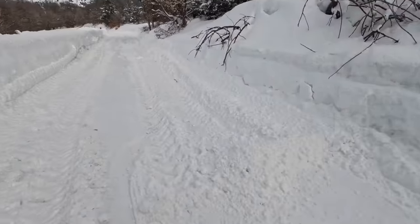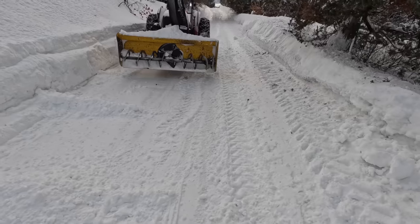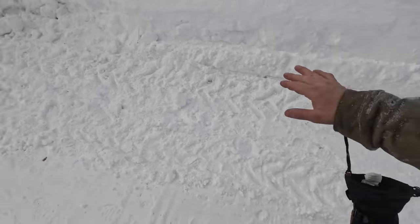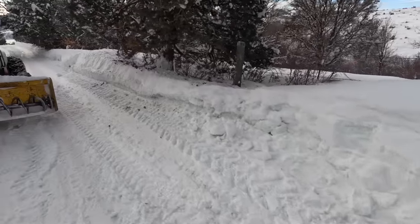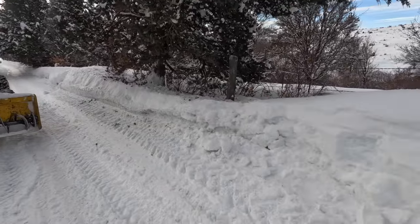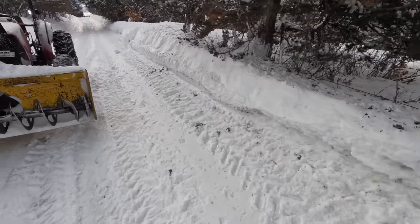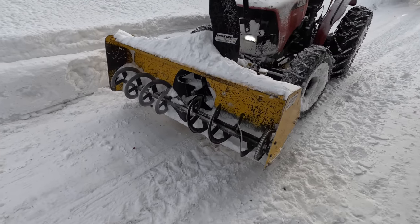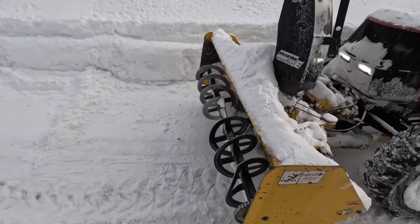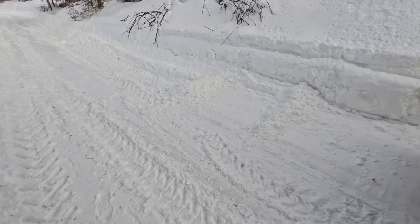This spot is just narrow, and I was just trying to open it up. We almost had it. I'm having a hard time on this spot. It's like it's compacted hard enough on this side, either from wheel track or snow blowing or from plowing, whatever. But it's packed up enough that I'm floating up onto it instead of cutting into it. And I could probably do a little bit of adjusting on the blade angle, try a few things that way to get it to cut in better. But honestly, it's just a matter of trying to keep it open and drivable.